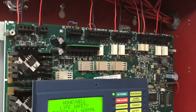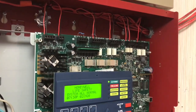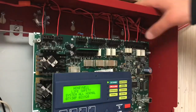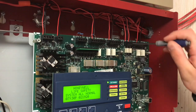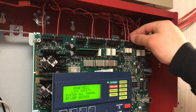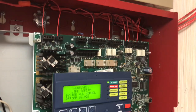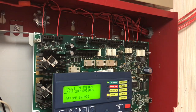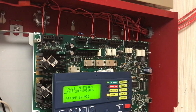I'm going to show you what happens if I don't have all four wires in the terminals. I'll unscrew the OUT terminal and remove one wire. As you can see right here it says 'LCD-80 Supervisory,' and in the background you can hear the LCD-80 — it says 'communication fault.'